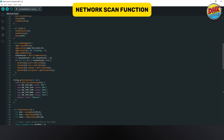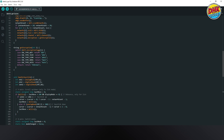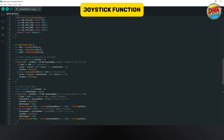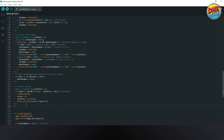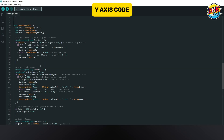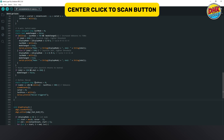The scan networks function scans for up to 20 Wi-Fi networks, storing their SSIDs, RSSI, channels, and encryption types. The get encryption function identifies a network's security type. The joystick's x-axis lets you scroll left or right through Wi-Fi networks or switch between list, bars, histogram, and details modes. Buttons on D3 and D5 select a network for details or confirm mode changes, making control intuitive.